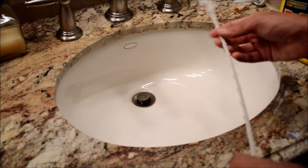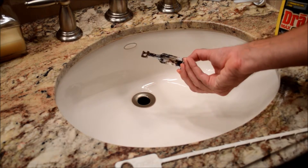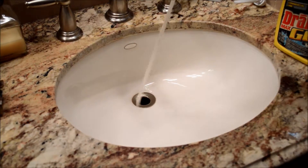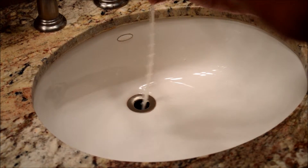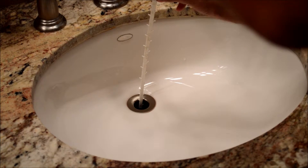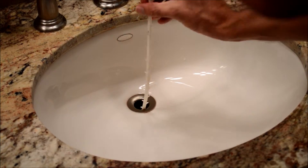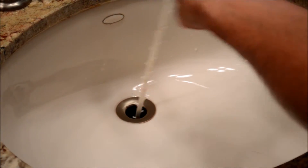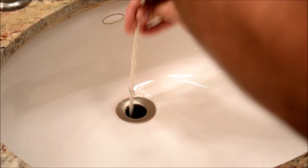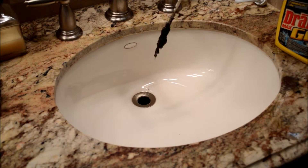Let's go ahead and proceed with unclogging the drain. First thing you want to do is pull this out — you can see it's got a lot of really disgusting gunk on it. Set that aside. The real trick is you want to put this guy inside. You're going to have some resistance if you have a clogged drain. What I do is twist it, because nine times out of ten the problem is going to be a bunch of hair — shaving hair, hair from brushing — and so forth. I work it down in there a little further and keep twisting. You'll have a wonderful glob of some really disgusting hair and slime and everything else.